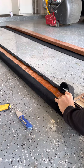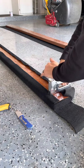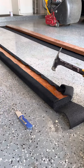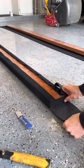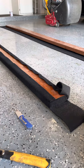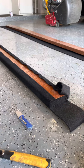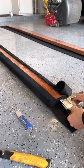Let's go ahead and staple that — get it as tight as possible. Push down hard on the staple gun. I've noticed on the staple gun, make sure you're pushing hard and putting a little weight on the top of it — it makes the staples go much further. Otherwise you'll have to hit the staples with a hammer just so they're penetrating far enough into the wood. Again, this wood I'm using is just pressure treated lumber from Home Depot. It should do just fine and last at least 10 years since I sealed it all with the polyurethane.